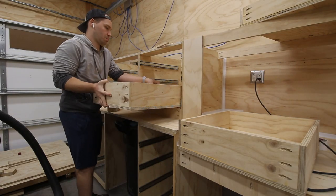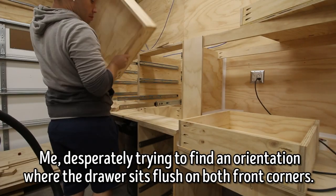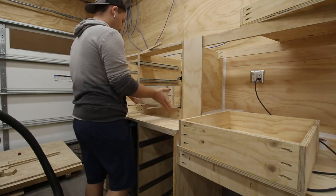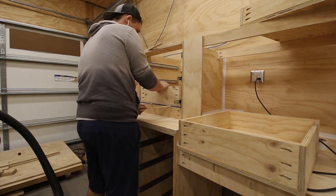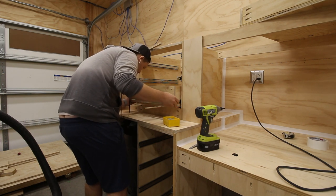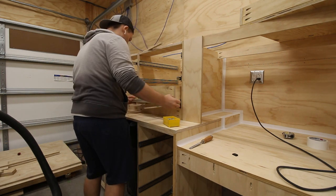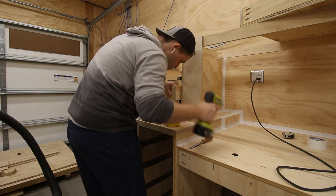On the middle and top left drawers, however, I ran into a slight hiccup. In order to have one side of the drawer flush with the front of the drawer slides, the opposite front corner had to be inset by a decent amount. Thankfully it only happened on two or three drawers, but the worst of the worst was out of square by over ½ inch. After kicking myself over this for a bit, I realized there was really no fixing it at this point, apart from rebuilding the affected drawers, and that would have used up a decent amount of plywood. I also realized it wouldn't be obvious in the finished project once the drawer faces were installed, so I decided to move along.